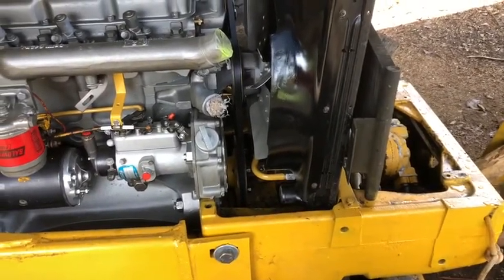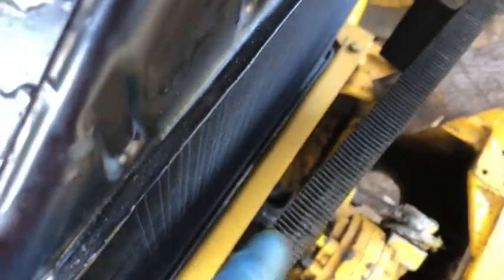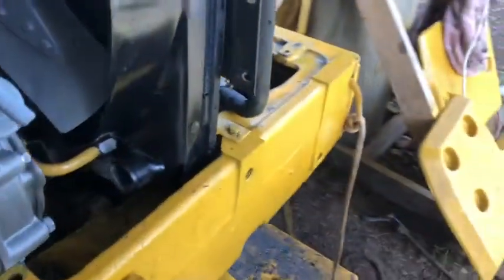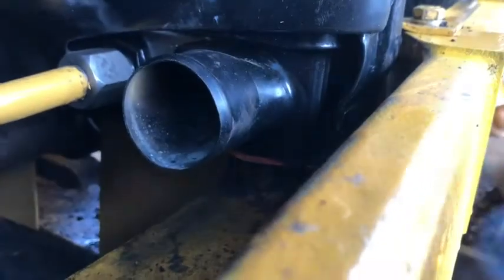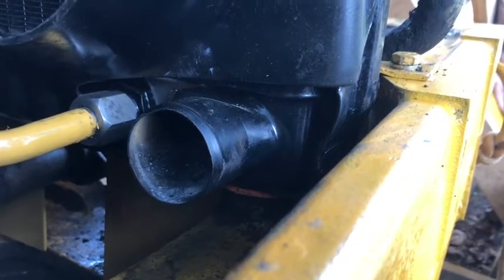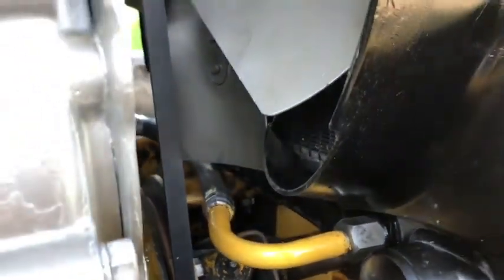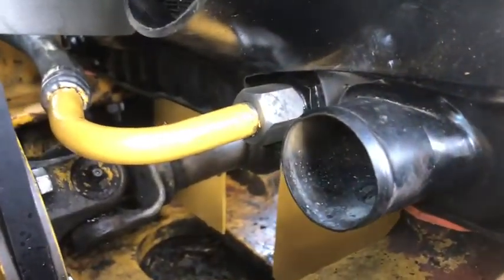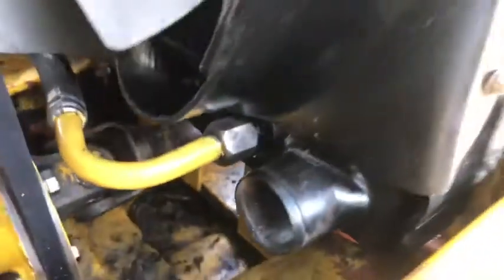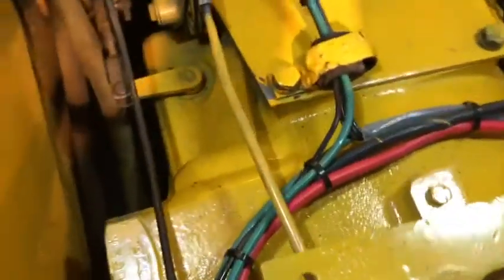I had this yellow plate down in between that was out, and there are two carriage bolts - the carriage bolt head points up and can slip into the radiator, but I wasn't able to click it in once the radiator was down in place. I've got this plastic pushed up that I'll have to sort out before going further. I'm just starting on my lines that go to the transmission cooler - one here, one on the other side. I rewired the whole thing, reusing only a few original wires since everything was cracking. Routed through here, put a new rubber grommet in, zap-strapped back, and put heat shrink on all the way up to the alternator.